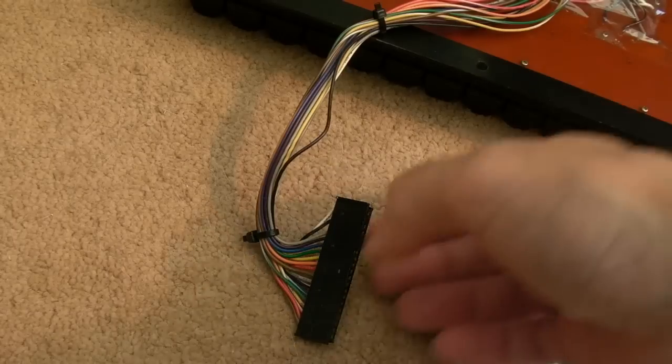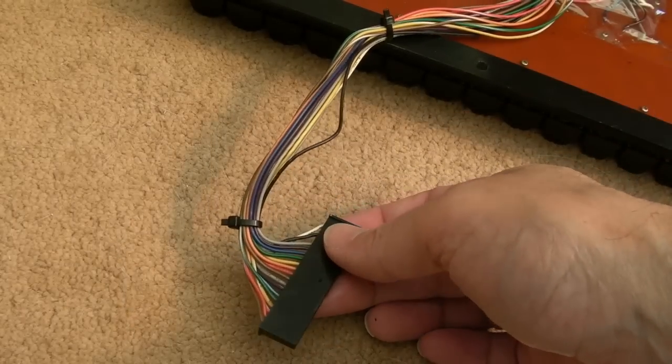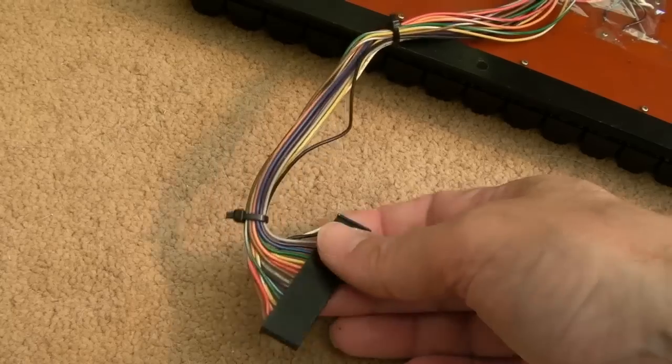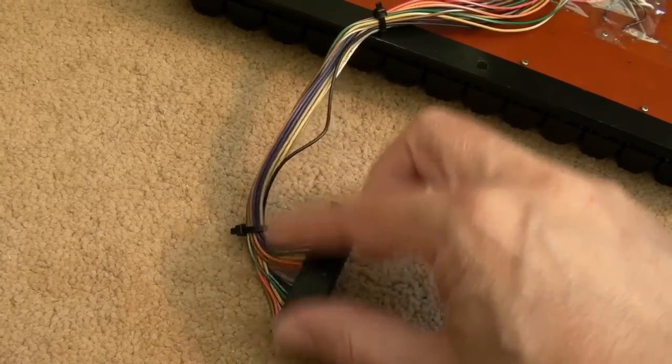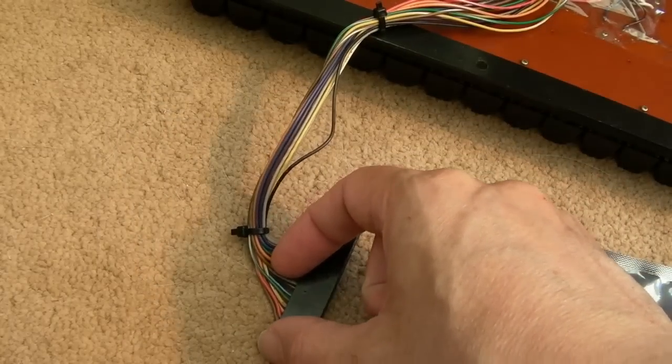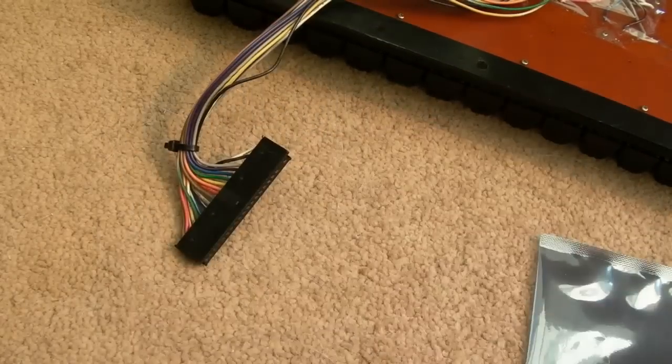At the same time in this video, I thought it would be useful to show the digital side. Just talk about what else can go wrong. So we fixed the keyboard you've just seen, but you just have this cable that comes off here, and all these wires are going to that PCB, which is, you know, half of these are going to be rows, half of them are going to be columns. Not necessarily in the order I've just indicated there.